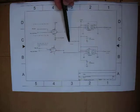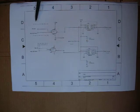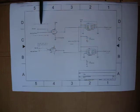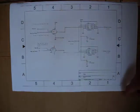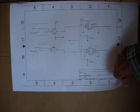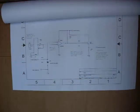these are the A from the oscillator, the 556 timer, and I've got positive lead, positive cap enable. If both of these are low, then fill the cap. So that means this is going to dump the energy from the FETs, through the FETs, into the two capacitor banks, one positive, one negative.